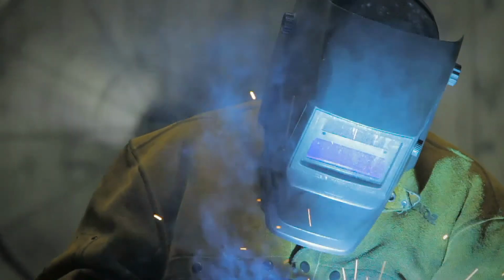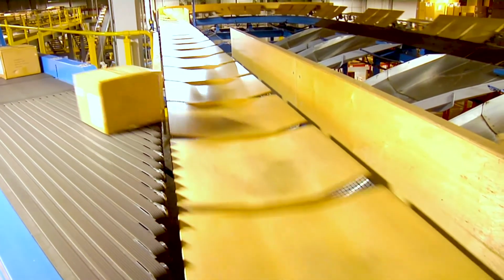We've had the sorter since the 80s, but we've been building it ourselves since 2009. Start with the track. It's fabricated from steel, welded together in sections, but bolted together in the field. The drive is a worm drive, so it's machined from really just a large chunk of metal. It has never worn out. And then the trays themselves are fabricated from wood.